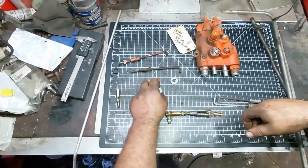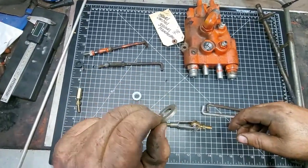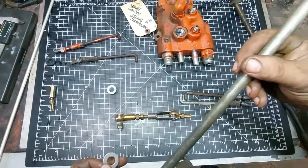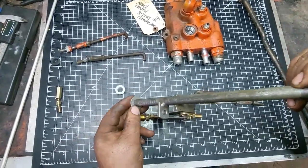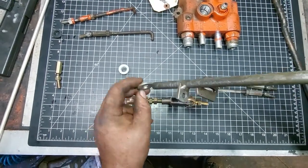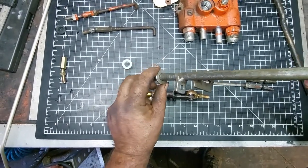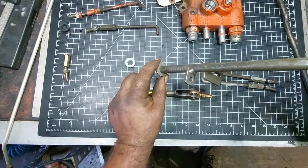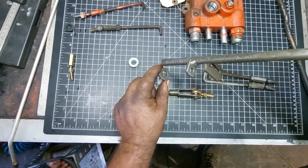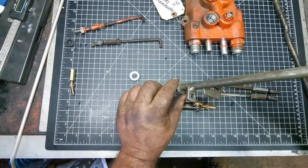All right, the next thing in the kit that we supply is an oil impregnated bushing. The factory ones are nylon, they wear very quick, and where this goes is on the bottom of your lever. There's a cross member bracket on there that holds your steering gear and the steering shaft. This sits on a recess, and the nylons wear very fast, and then you get play with the shaft inside this bushing. That all contributes to the linkage of your travel control. So we put this new oil impregnated metal bushing in there, and that'll last you a lifetime.